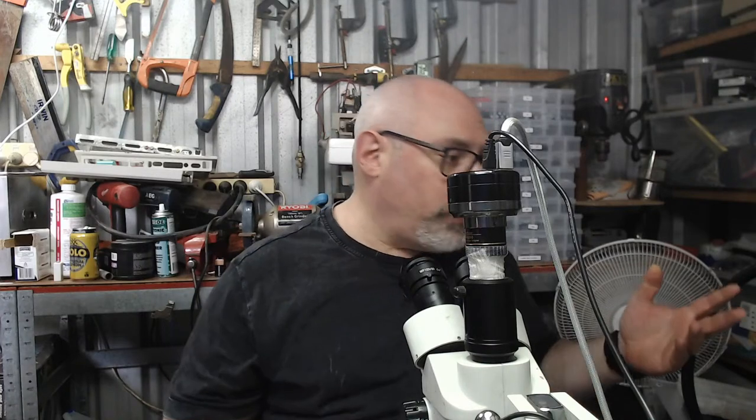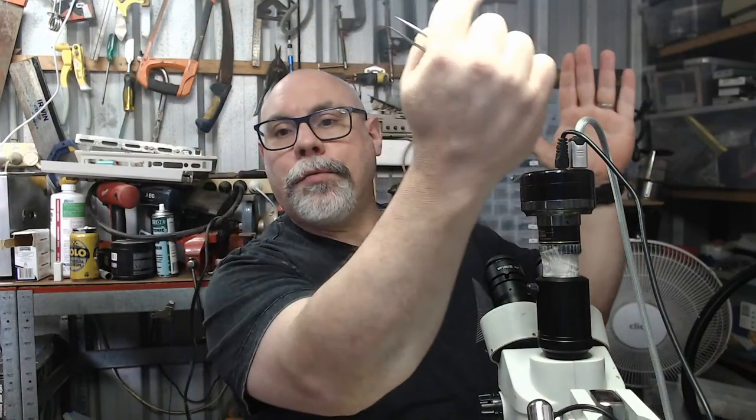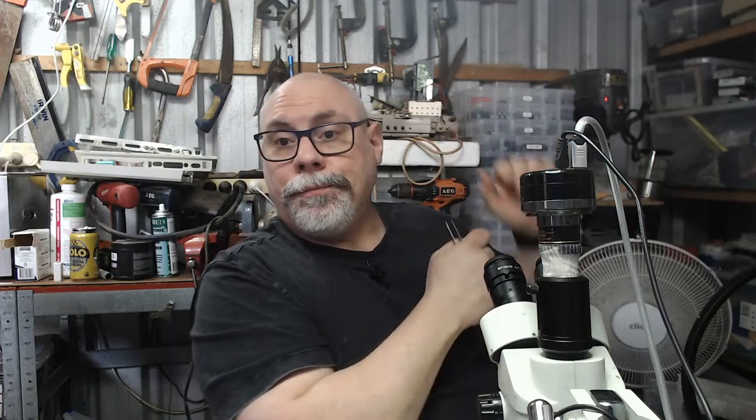Trying to put my second 2Ci I bought in the dishwasher and it didn't work. I think it may be getting... Okay, so Michael, the important thing to keep in mind with the 2Ci, I don't have one here unfortunately, so I can't show one off. I have one up in the house, but if you are holding the logic board facing you, up at the top right-hand corner you would find the power button. Directly below that power button there are a couple of capacitors, and below that a couple of little diodes, and that whole section is the startup circuit. Because there are electrolytic capacitors in that area, it's really common for the traces to get damaged and affect the startup circuit.